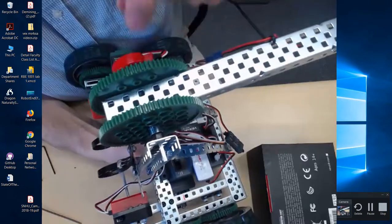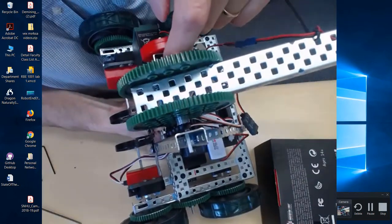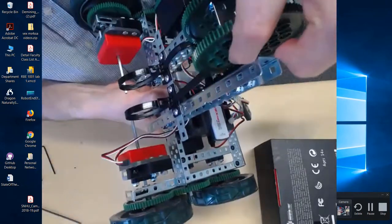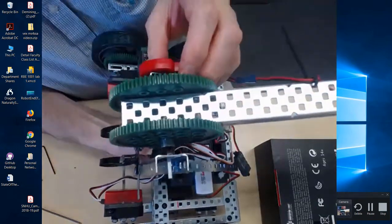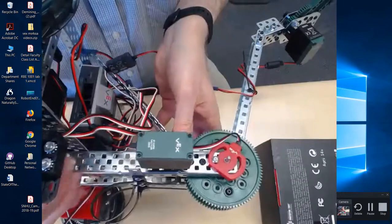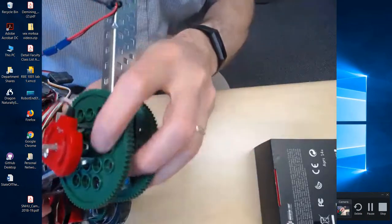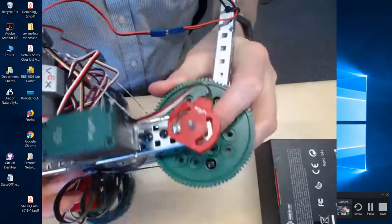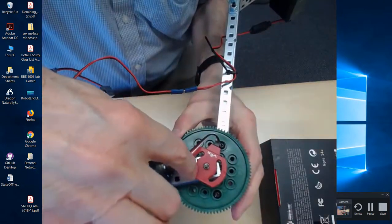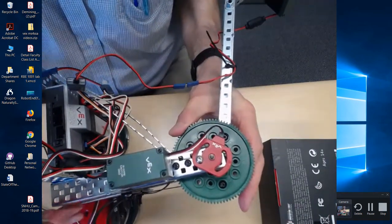And so again, just to review, instead of the C channel facing out from the robot, I'm just going to turn that around so it's facing in. You're going to put these bearings on the inside of the C rather than on the outside of the C. Okay, and then for this hole right here, which goes through, you have your bearing right in here, inside there. Okay, and you have a screw that's going through, a 7/8 long, 7/8 bolt, so that you can then adjust the encoder. Okay, so let's talk a little bit now about how to adjust the encoder.